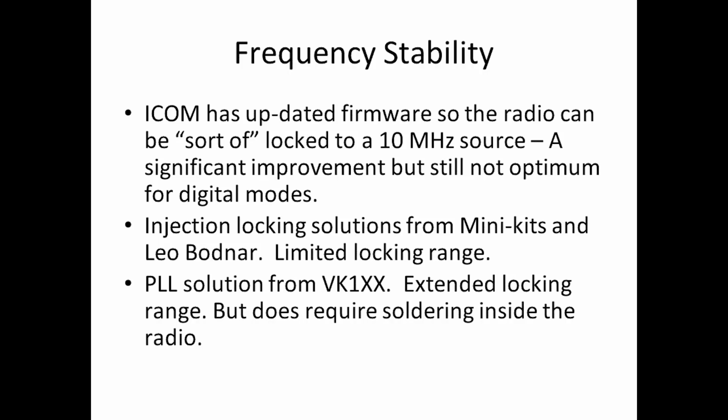Fine for FM or maybe sideband if you're prepared to keep tuning. But for a radio that had so many other brilliant features, I think it was amazing how they stuffed up. Because for another $20, they could have locked it properly. They've made some attempts, mainly because people like me fairly savaged them in reporting on it on the web, so that they've automated the crystal calibrator function, so it tries to recalibrate itself every couple of seconds. The trouble is it can't do it perfectly accurately, and you still get some drift while it's catching up.